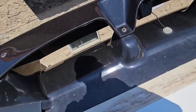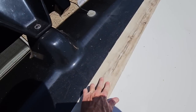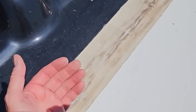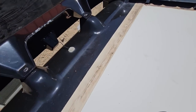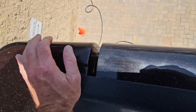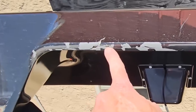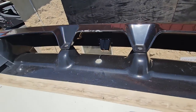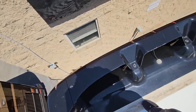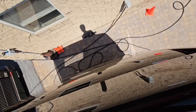Starting back here, we'll find the rear cap. This is a gel coat fiberglass molded roof. There's a seam right there — the hardware that secures the roof to the framing underneath is going to be underneath this tape, but this tape itself is just a diverter. It's not Eternabond, but it is a roof repair tape used as flashing. Surprisingly, I don't see anything wrong with it. Looking at the rear cap, I do see a little bit of stress cracks everywhere, and the spoiler looks like maybe at some point it hit a branch of a tree. But this was stored indoors, so I'm not seeing a lot of paint peeling at all.